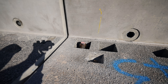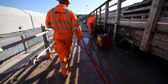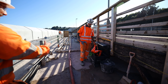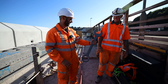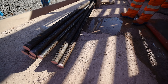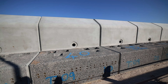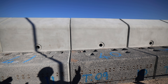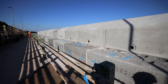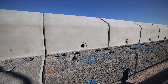The bars which go into the units are the biggest bars you'll ever see — 57 and a half millimetres. Let me show you the spanner for it. Harvey's hands make it look big but even so — it's just enormous. And these are the bars we're installing. There's a lot of steelwork tying everything together. When we cast the promenade unit and the recurve unit together, we cast them in bays of six — six recurve units and six promenade units stitched together in one slab. The finished walkway level is roughly the same height as that black pipe coming through the wall.